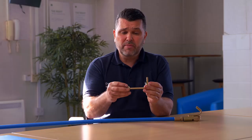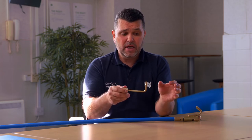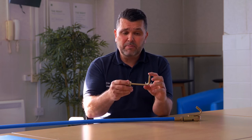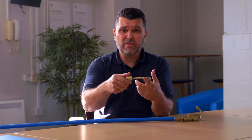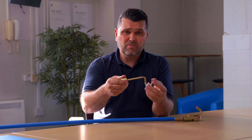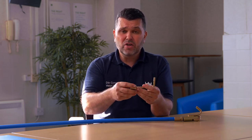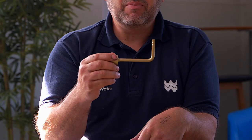The single claw can also be used for many other things. For example, if a plunger has come off your rods, there's a hole in the centre of the plunger. If you manipulate the single claw into that hole, you can pull the plunger out of the line. Whatever you can get it over the top of, it can be used to drag things out — shards of concrete, stones. Once it's on, just use your imagination. You'll determine what you need from the kit when you see what's in front of you. The single claw is mainly for getting wet wipes out of voids and removing plungers.